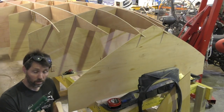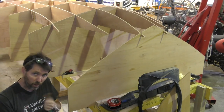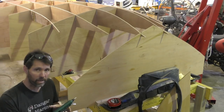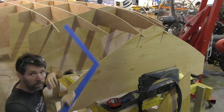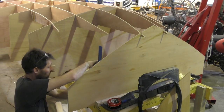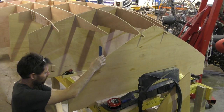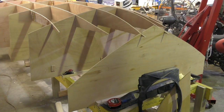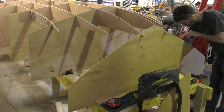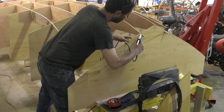One of the other reasons for using these hot glue guns is that they're not particularly permanent. If you do need to jiggle something later, you can crack the glue off, move it, and then pin it back in position again — nowhere near as permanent as the epoxy is going to be. Just going to use a reasonably large roofing square to get this plumb. We'll just check both sides. All right, that's all the longitudinals in position now.